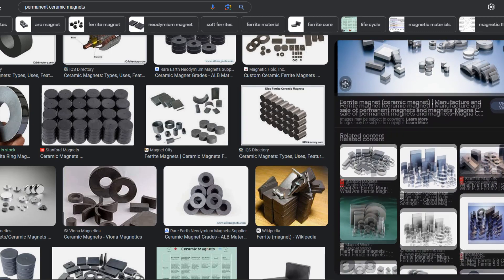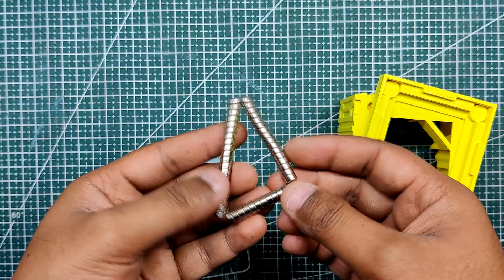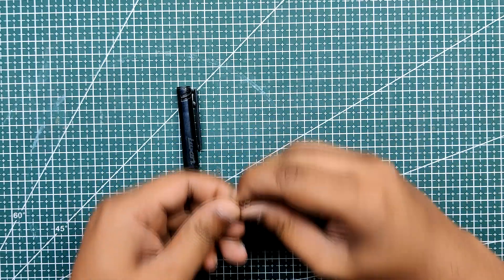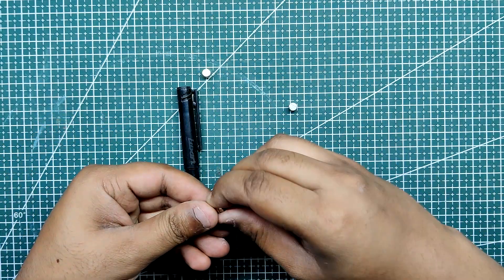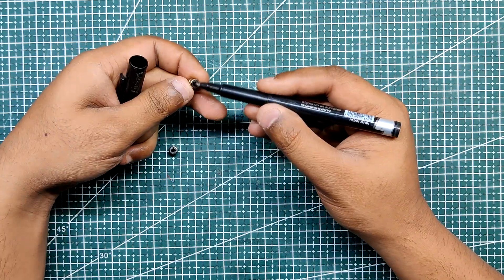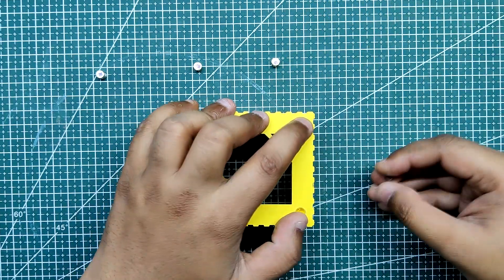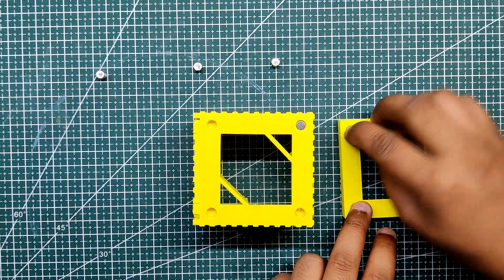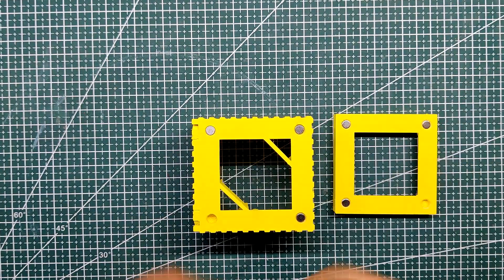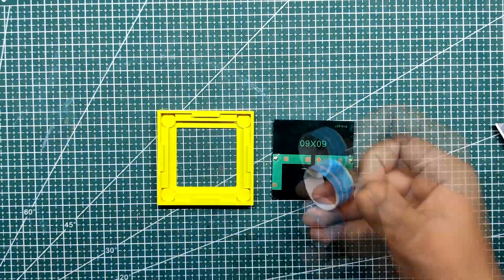In this project we are using shiny round ferrite magnets, also known as ceramic magnets, which are a type of permanent magnet made from a composite of iron oxide and barium or strontium carbonate. They are known for their relatively low cost, high coercivity, and resistance to demagnetization. We start the magnet assembly by first grouping them together — pairs of two are required for each edge. We mark each pair so we can attach four pieces to the mid-body first, and then add the same pair to the solar panel holder. We place the panel in the 3D-printed holder with double-sided tape.